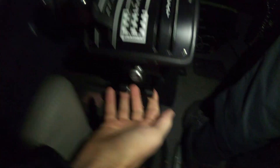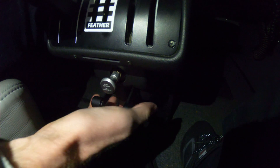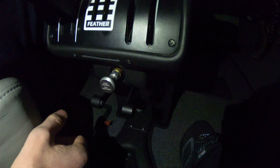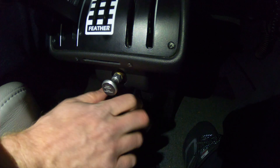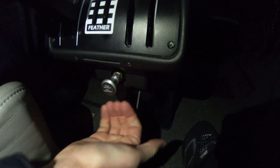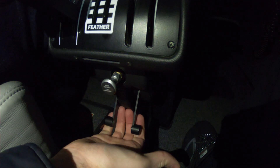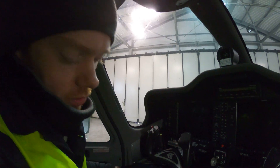And your chokes — you've got two levers here which are your chokes for both engines. When do you use them? Primarily on the first flight of the day, or if the engine is in any way cold, you want to open your chokes — that's straight down, fully depressed — and then close them as you'll see later in the flow or in the checklist. This is unusual compared to other aircraft you might fly, like a Lycoming or Continental engine in a Cessna — this aircraft has the Rotax 912 engine, which has chokes like a car engine.